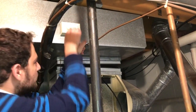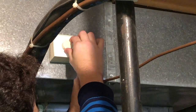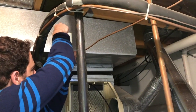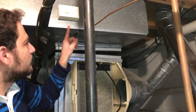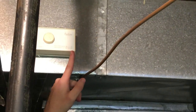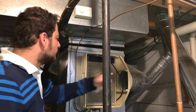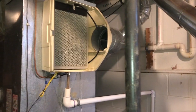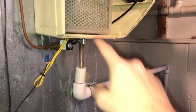See, this is how you control. I'm going to put my finger here, so we'll put exactly where it came from. You can see when it's warmer, you want less humidity, so you drop it down, and then when you get in the winter time, it gets very dry, you turn it back up. That's where it is. It's on max right now, so it's about 55. That's unrecommended because it says when it's 25 degrees out, you want 35% humidity, but we have it up to max because I get a lot of bloody nose since it's been kind of dry. So that means the humidifier is going to come on every single time the heat cycles on, and that's the humidistat. It controls the humidifier. Here's where the water returns back to the waste if it drips too much.